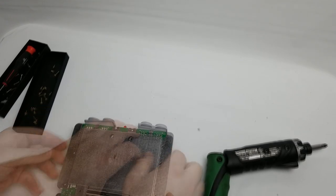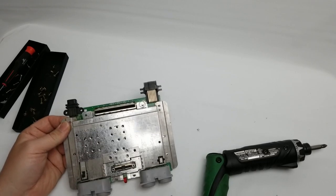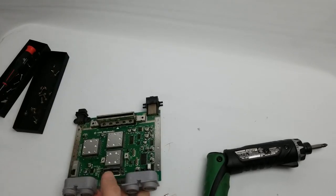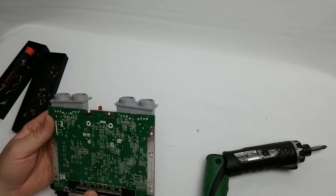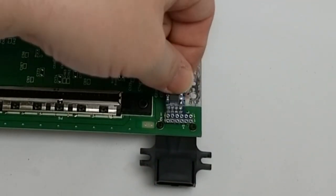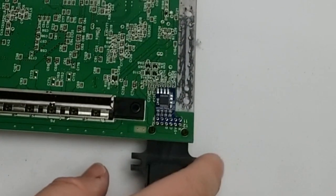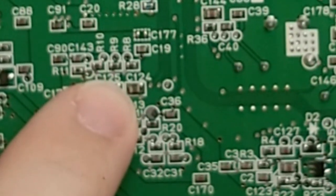At this point we're going to remove the shielding. We're going to clean up all these metal bits as well to keep everything as clean as possible going forward. This is revision three on this board — that's important to note. I do have some crud and corrosion there, which is no bueno. The mod board will essentially sit right here on the main board and we'll solder it into place. We're looking for R8, R9, and R10 on the board. I need to prep my wire.